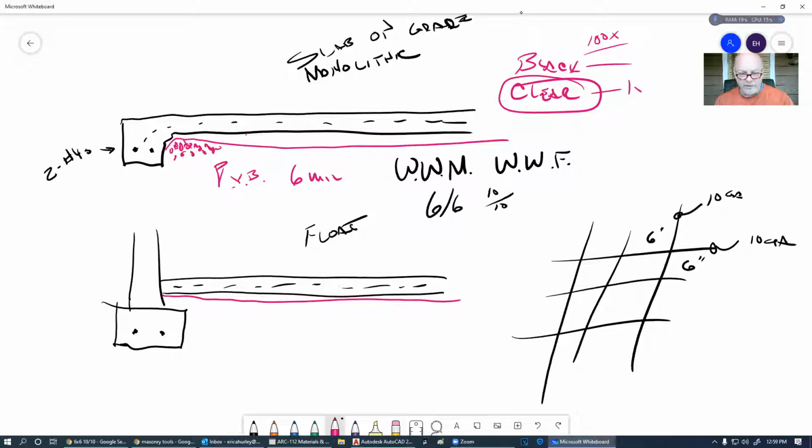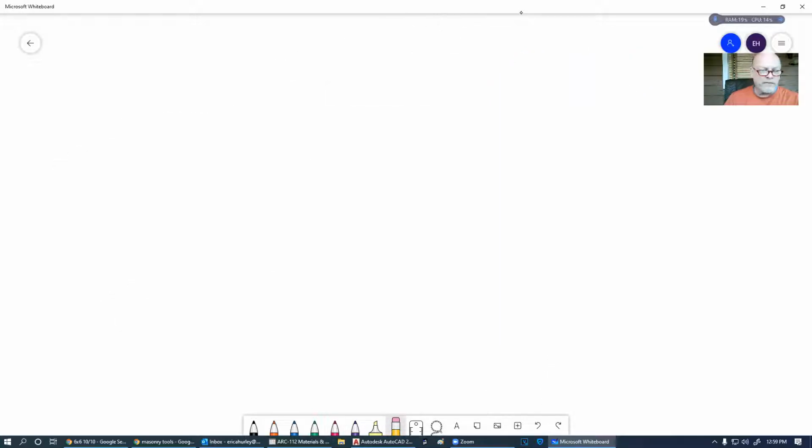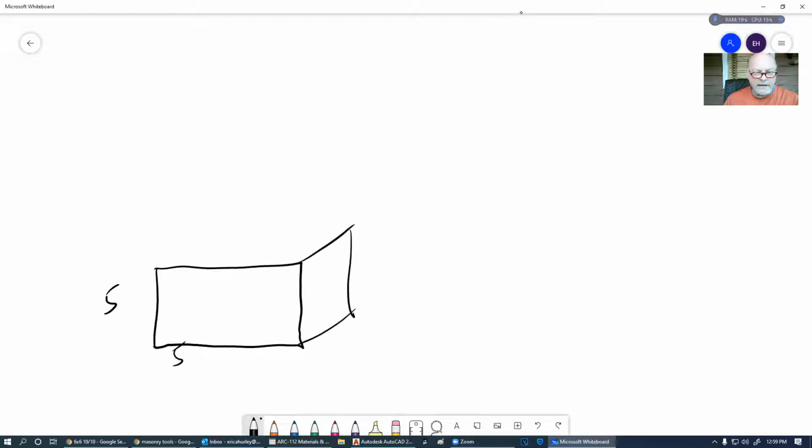So now that you understand that, let me go back to that picture that I had. Sometimes I get a little carried away. So we were talking about the isolation footing. And this is, again, 5 by 5 by 5. And these are so huge due to uplift rather than bearing. I mean, yes, we want it to bear some, but these are huge so that they don't just up and lift away during a hurricane or something.